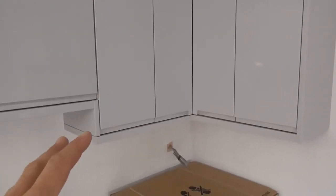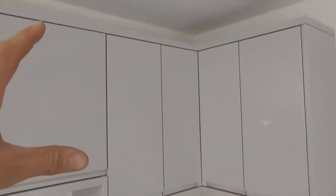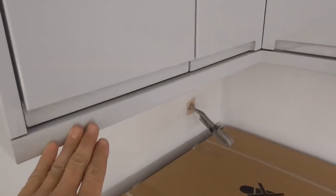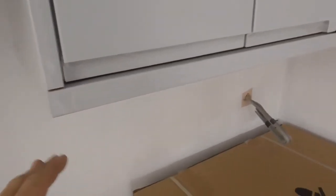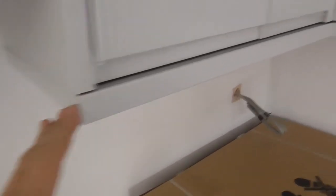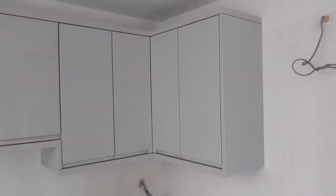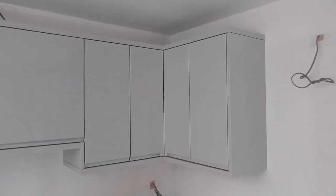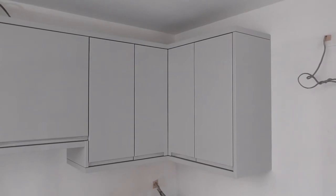So this lighting baffle and cornice, it's a gloss finish plastic coated MDF, and it's really important that you take your time when cutting your mitres and any cuts that you do, because there really is nowhere to hide. If your cuts aren't nice and tight, it shouldn't be particularly difficult, to be honest, because the mitre saws that we use nowadays, I mean, the mitre saw that I use is an Elu PS274, and it's 27 years old, and it's really, really accurate.